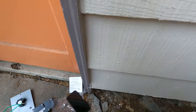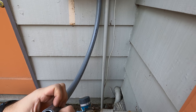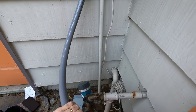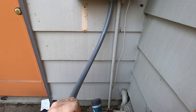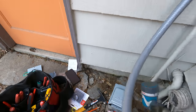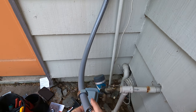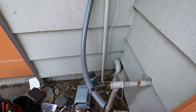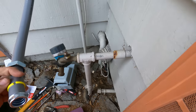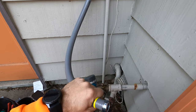And the reason why I'm using the grinder is because there's that metal inside. Also, at the edges, we are cleaning the rubber outside because the nut that needs to be put on the connector is a little tight, so we have to clean that out. It's not a big deal, but sometimes it does go in without cleaning that up, but it's a much easier process to get that going in. And then we're going to put that seal, the yellow seal, in the part of the connector that attaches to the other side, and then we're going to tie this down with the channel lock.